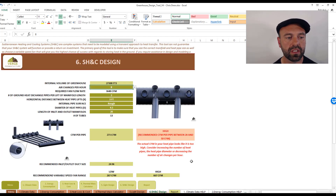Next we have a subterranean heating and cooling system calculation. This allows you to size a fan and make sure the ductwork you're choosing will work for your particular greenhouse. The system uses simple fan laws built into the back end of the tool, and it allows you to design a subterranean heating and cooling system that stores hot thermal air underground during the day — when the greenhouse is really warm — so that it can be released at night or at cooler times of the week or even the year.